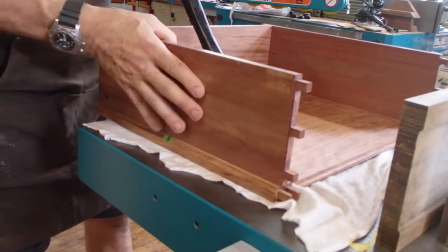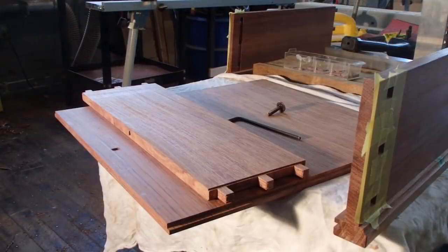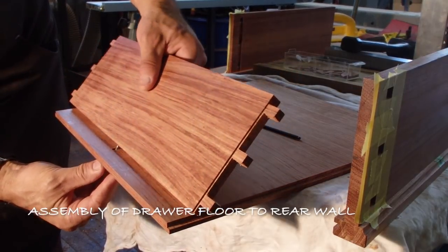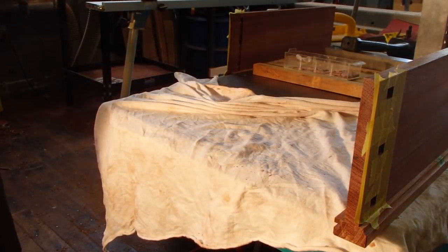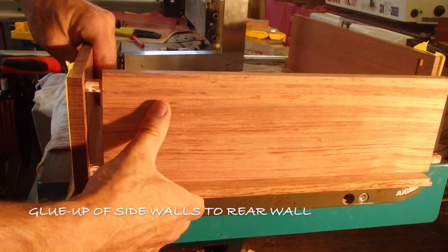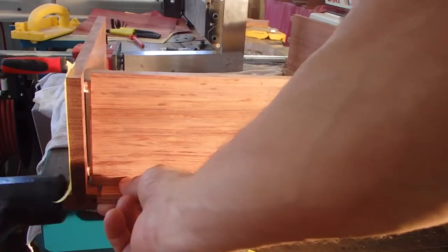Drawer construction on this cabinet is all mortise and tenon, and the drawer sides employ an applied runner which is held with a sliding hammerhead joint. Since these joints are wedged and won't be demountable, I'm assembling them using a more permanent sort of glue, namely a yellow glue. I think it's Titebond 2.